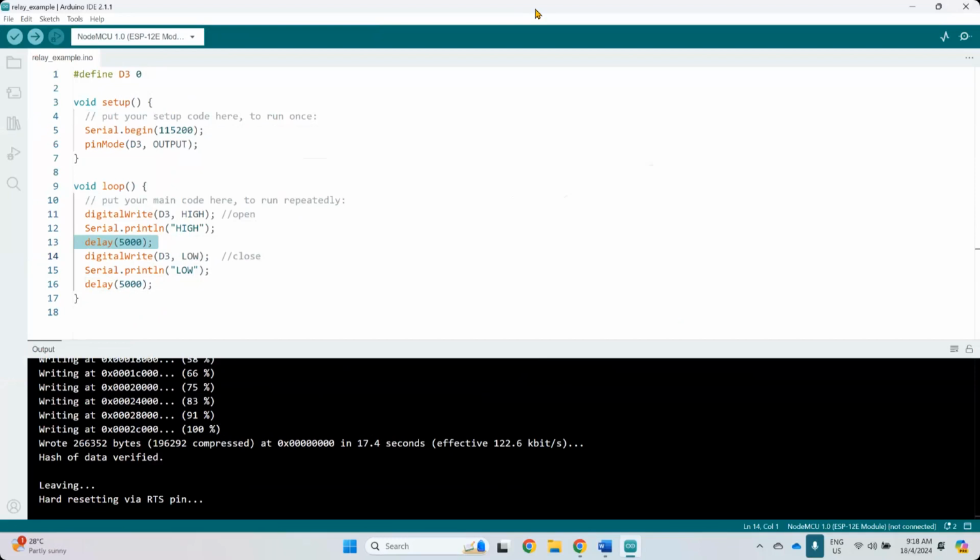Because the higher the baud rate, if you mistakenly set it, this is digital communication. If you understand about discrete, you studied discrete, right? The discrete is basically just data like 1010, when you have 8 bits. When it sends this 8-bit signal, if you set it too high, the signal can be disrupted. You have gibberish data. That's why you can see weird characters appear on the screen. It means that you have miscommunication between your serial USB port and the microcontroller. If you set it too high, you might get issues. If you set it too low, you might also get issues because there is no discrete synchronization between the serial communication. So you need to understand first the maximum baud rate that you can support.